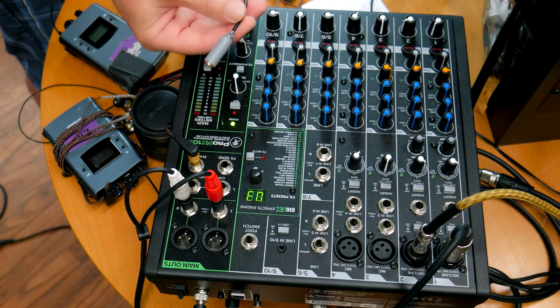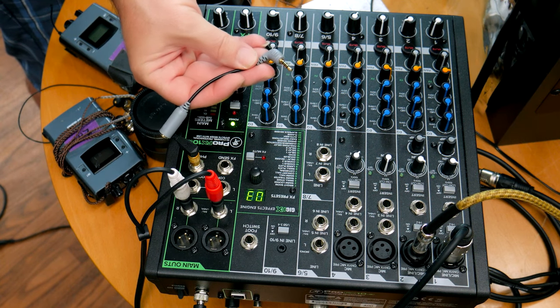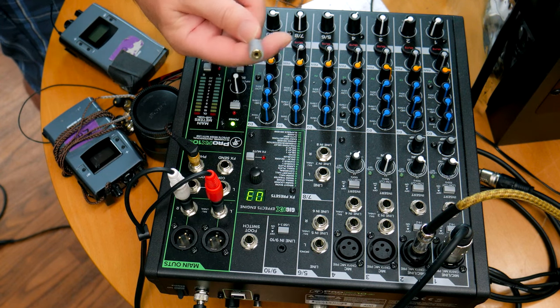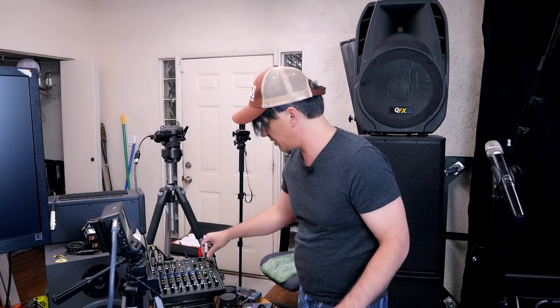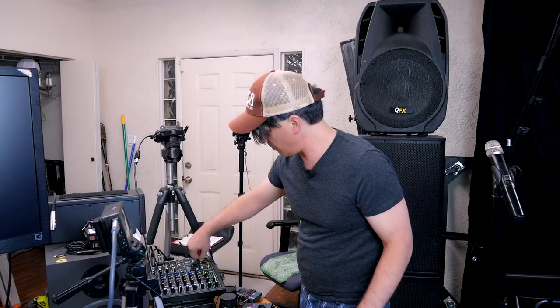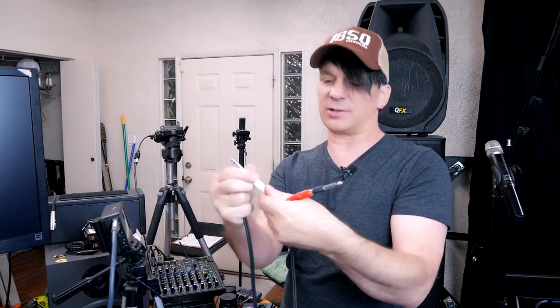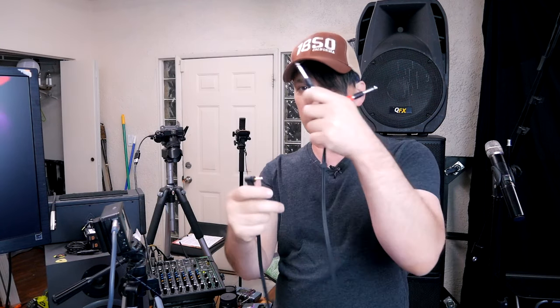This is a little $12 adapter. It takes it from the TRRS — the three rings — and then lets you plug in a TRS, which is the input right here. So then you need a cable like this — I'll have this in the link in the description like on the last video. This is a TRS cable and then it goes to a quarter inch. Mine goes to RCA, but you really want it to go to quarter inch. The link in the description takes you from TRS to quarter inch.